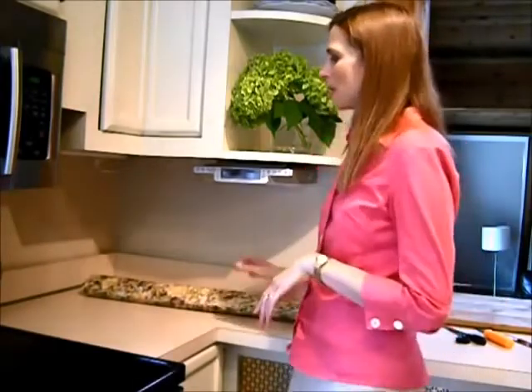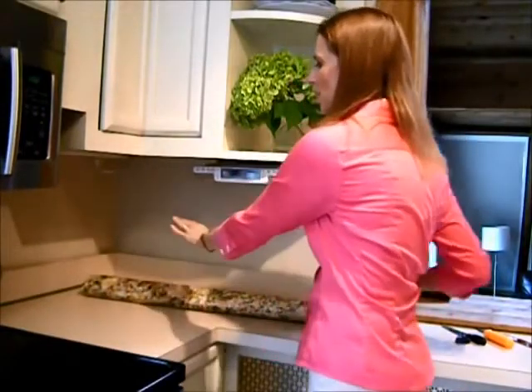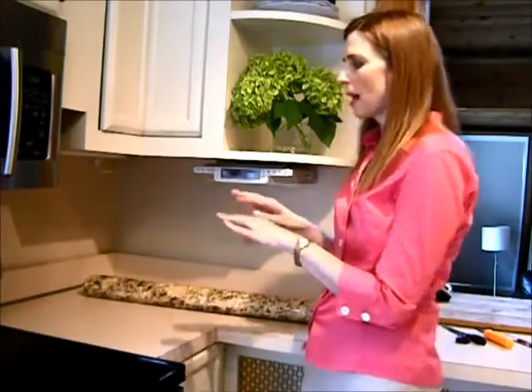Now I'm going to show you how to tackle the dreaded corner. There are a couple of ways you can do this, and whichever way you pick, it's going to look fabulous — chances are a million times better than your old laminate counters. The easy, no-fuss way is to take two strips of film, run one of them this way and one of them this way so they are perpendicular to each other. Because there's no definite pattern, the pattern's going to overlap and you're really not going to see the line where they come together.